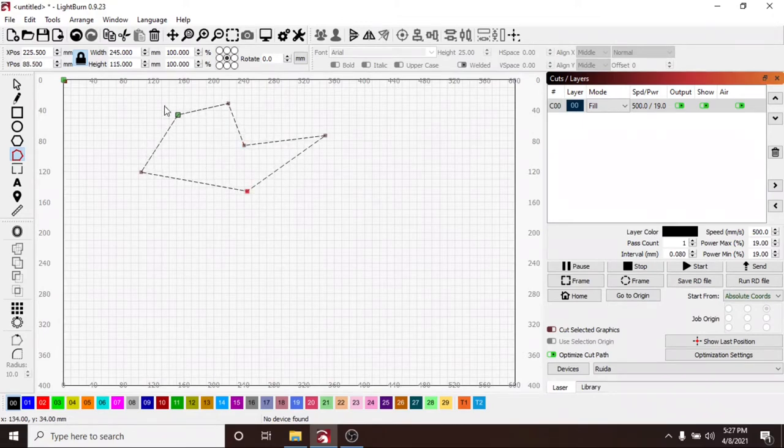These are called nodes, and they are used in scalable vector graphics files that you'd create in Adobe Illustrator, or the other option, Inkscape, which is a free open source vector graphic editor. The main concept behind scalable vector graphics files is that, compared to JPEGs and PNG files, they use these things called nodes, which are really handy for editing and keeping proportionality for your images. Whereas a JPEG picture uses pixels and doesn't work super well with the laser cutter for cutting out shapes. It can certainly engrave JPEG files that you import into this software, but for anything else, these handy tools right here for creating shapes, or using different vector editing software, will really be beneficial for creating your own designs to have the laser either cut or etch into different materials.